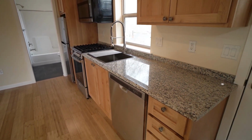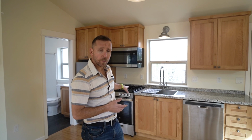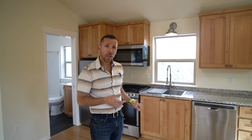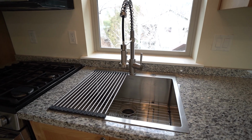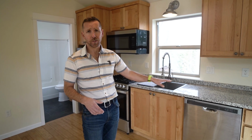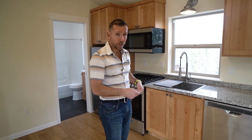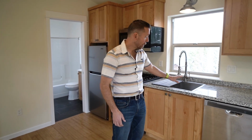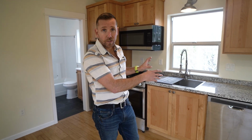This kitchen is only 15 feet wide, and some things that we do to save money are we use one piece of granite. So this is just a single slab. We use an overmount sink, so we're able to actually cut and tool the granite ourselves. So there's no big cost. I pay a couple $100 for this slab, and then I tool it with a skill saw and a garden hose with a diamond blade, and I'm able to set my own sinks. So what looks like a several $1,000 single galley kitchen, I can do for a few $100s.